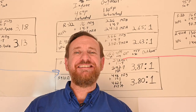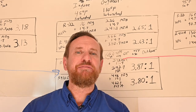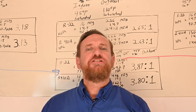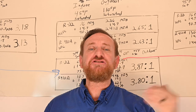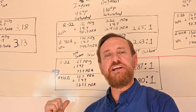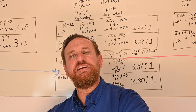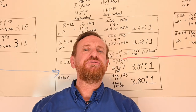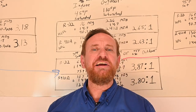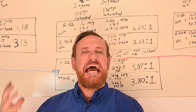The compressor in a refrigeration system is the same. Having a lower indoor temperature and a higher outdoor temperature makes that compressor overall less efficient — it reduces its capacity and capability. Think about your house: as the outdoor temperature goes up, heat tries to come back in. But if you set your house temperature lower, the heat from outside moves in at a much faster rate. Apply compression ratio to that — you're having to pump heat out to a high pressure outside because of high outdoor temperature, and also dig down to collect low pressure refrigerant. You're losing efficiency in two ways: heat moves in faster due to the bigger temperature difference, and your compressor is pumping harder and moving less refrigerant overall.